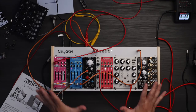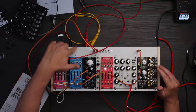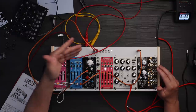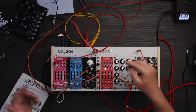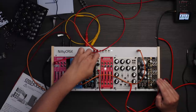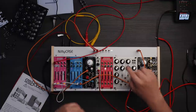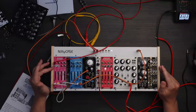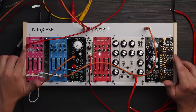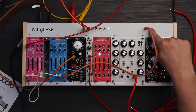Here's another little bit of a setup I've been using to test the case. First up I've been testing the MIDI to CV via USB and also tested the DIN MIDI, and it seems to be working as intended. CV and gate is set to MIDI channel one for CV/gate number one, MIDI channel two for CV/gate two. We have the mod and also the clock, which changes depending on the BPM in Machina.